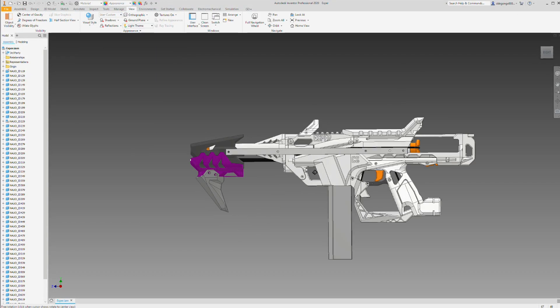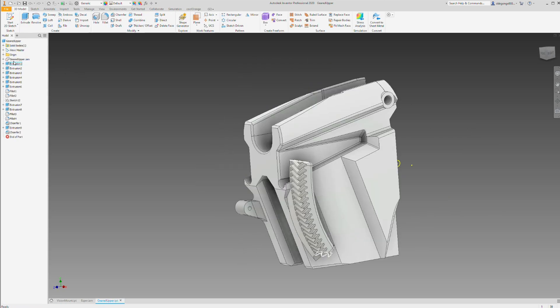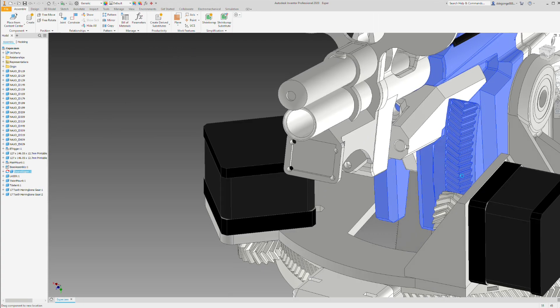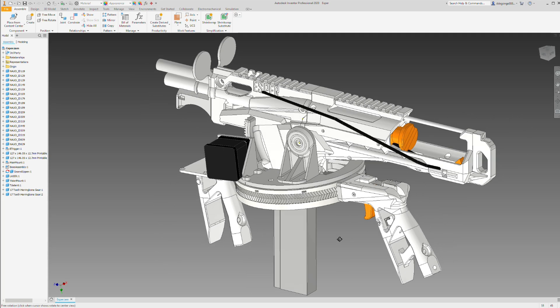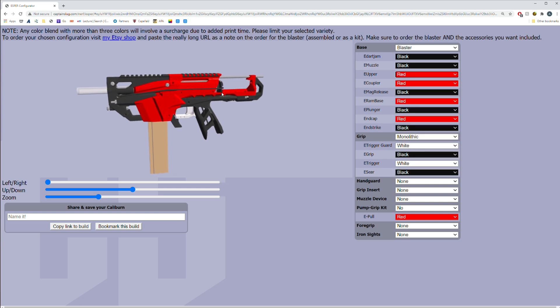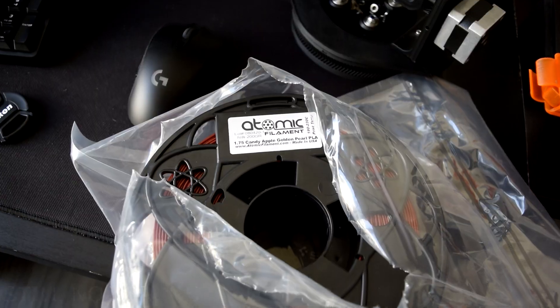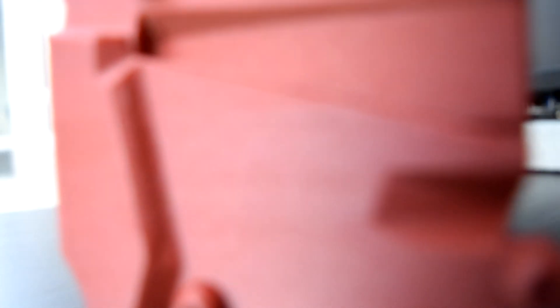So then I got to work in CAD. I imported the Esper blaster, added some bearings and some other features to allow for rotation and pitch, and then made it controllable with stepper motors using 3D printed gears and herringbone profiles built right into the printed parts. I used Captain Slug's online configurator tool to design a black and red color scheme, using the delicious-sounding Candy Apple Golden Pearl PLA from Atomic Filament. The parts look amazing.